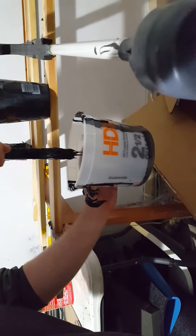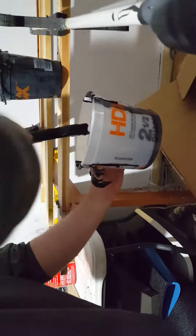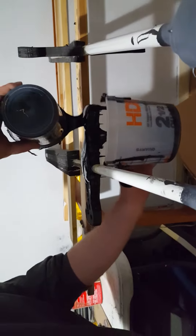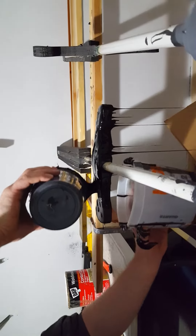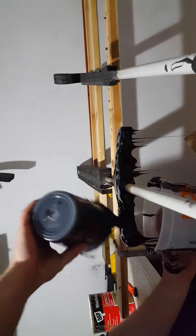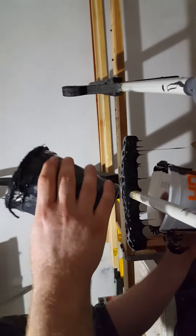While it's drying, go back and forth flipping it over. It is a messy prospect, so just be prepared for that — make sure you have something at the bottom to catch it. It's very important to make sure you let the dap cure. I let this cure about 24 hours, but normally the full 72 hours is the appropriate cure time for dap.